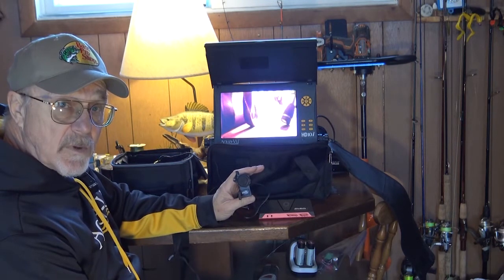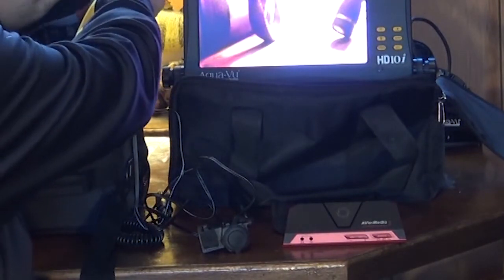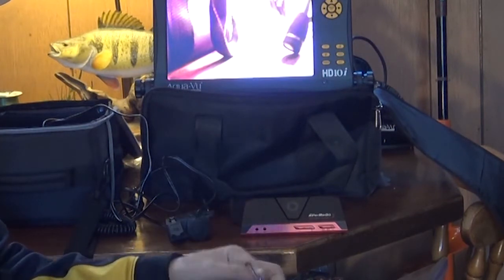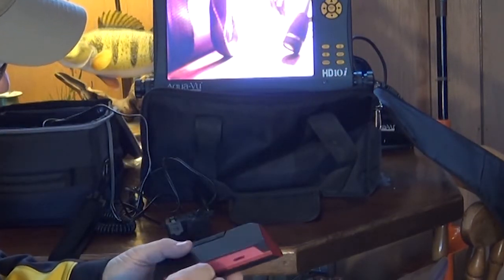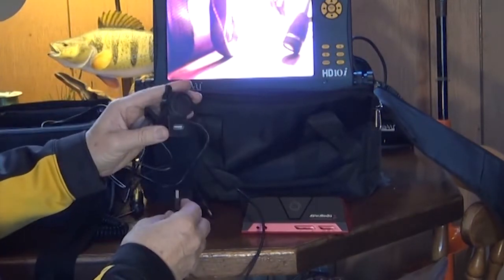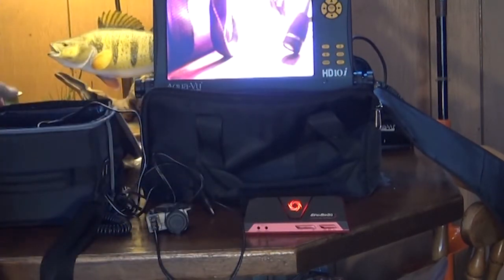Until I need to plug the camera in, I won't use the 12-volt, but I will use the USB power — that's going to power the Avermedia recorder. This cord comes along with the Avermedia recorder; it's a USB cord and it powers the recorder itself. Plug it into the USB port on the back of the recorder, and then plug that into the USB port on the power port. As you see, that fired the unit up, and it's not finding a signal — that's why you have that red symbol like that.